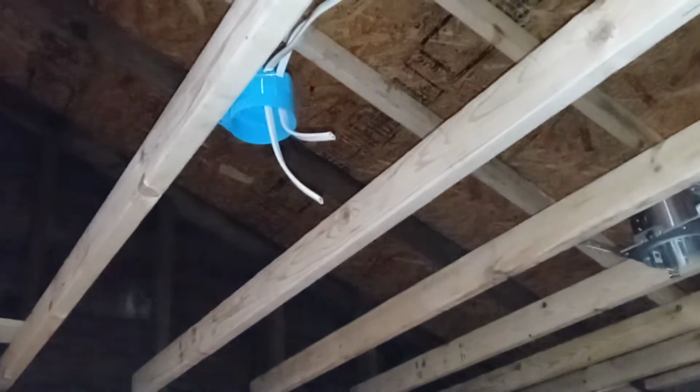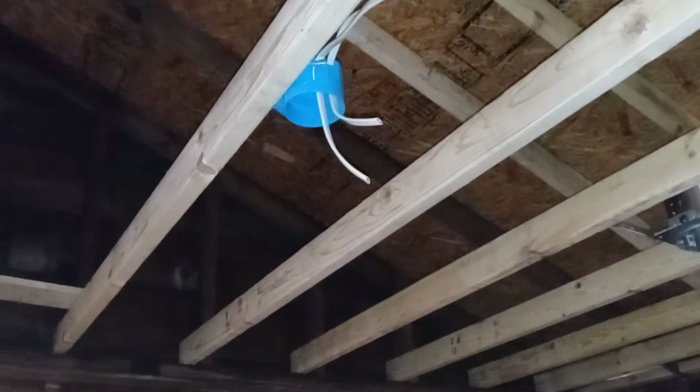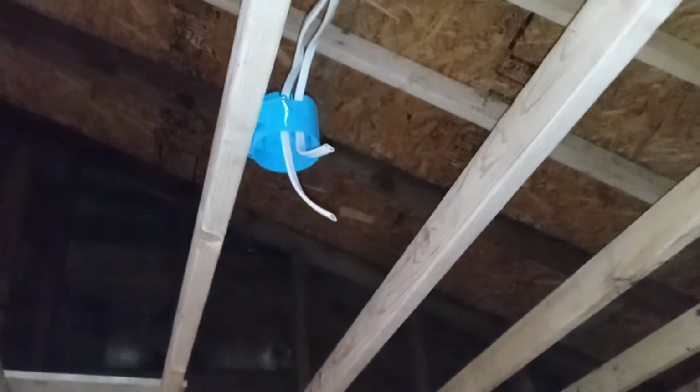But we already know about the recessed lights in here and stuff. But when you're doing a full, this is basically a rehab, not a remodel. And you did a complete gut out, you got to install inline smoke detectors. And that's what we came over here to finish up today. But, of course, we can't.